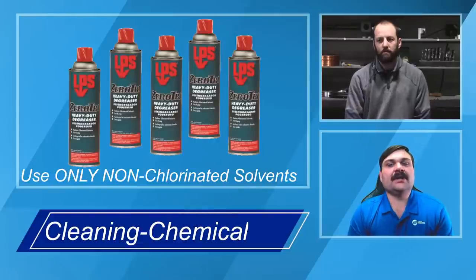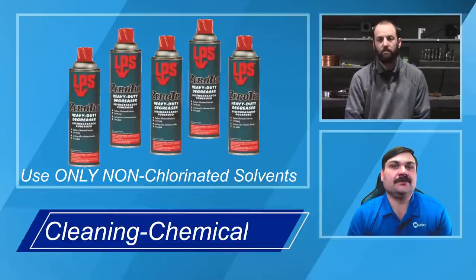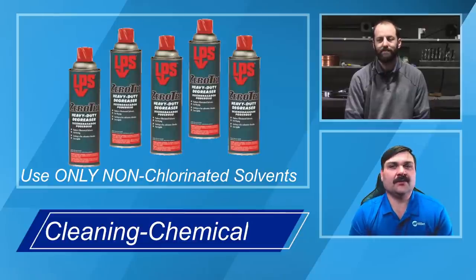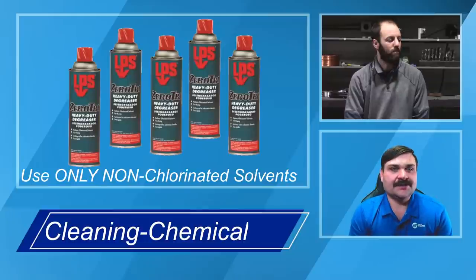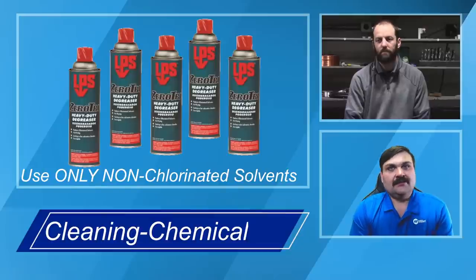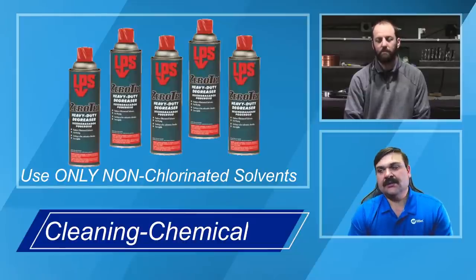It depends on what kind of environment you're in. Obviously, some are better than others. That oxide layer is going to begin regrowth as soon as you clean it. But depending on what level of quality you need to get to, if I wire brush it and I'm going to weld it immediately, 99.9% of general fab situations, that's going to be just fine. You put it in an oxygen-rich environment, it's probably going to start growing faster than in normal atmosphere, because again, it's aluminum oxide. It's realistically rust. What you would see on a vehicle on steel is somewhat comparable to what the oxide layer is going to be here.